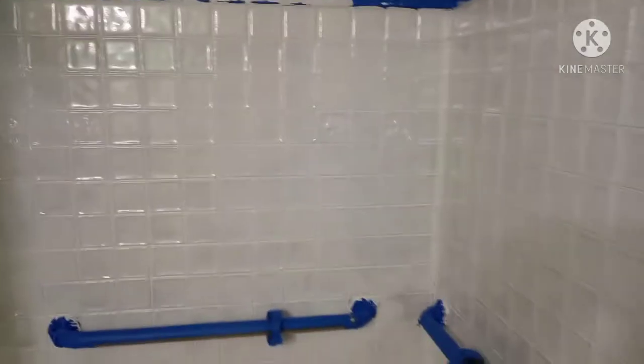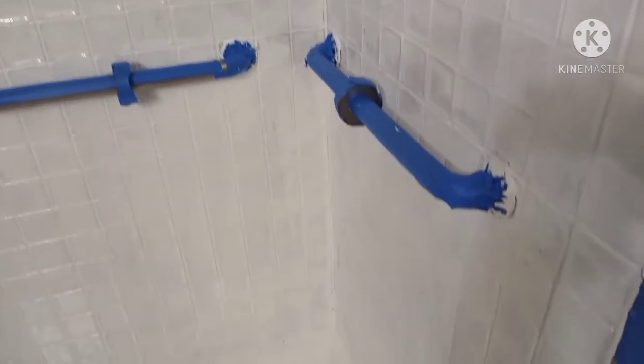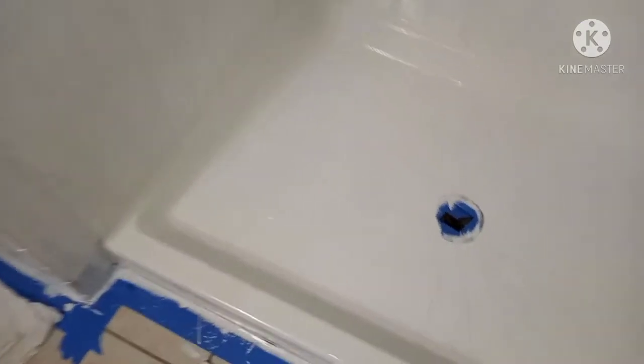The shower pan was looking really great, but that was almond color to begin with, so not a big change in color, but that brown tile underneath, definitely not doable in one coat. I was able to do this entire thing with the one kit for this coat, so it was appropriate. It said that it would cover this much, and it did. So if you're just redoing some white tile or almond tile, something like that, that might not be an issue with only doing one coat, but with this brown tile, definitely not enough with just one coat on that.